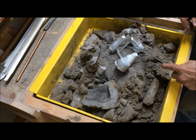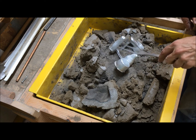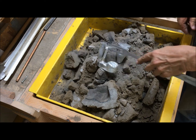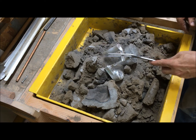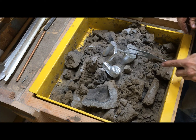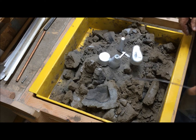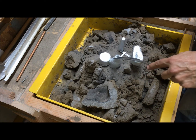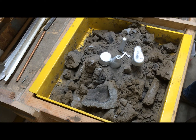Pouring basin, piece of foam, tapered sprue — tapered only in one dimension, it's a quarter inch thick the other dimension — and then the runner, the gate. I made one of these the other day with more shrinkage because I had a smaller feed riser, and it machined up real clean.